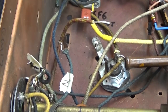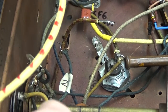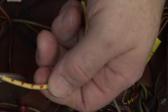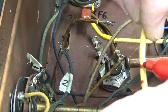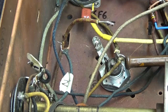You see this wire right here? If you look real close, you'll see that this is basically a yellow wire with some red tracer. So what I'm going to do is, since I don't have any yellow wire with a red tracer, I do have some yellow wire and I do have a red Sharpie — so why not just take a red Sharpie and make a yellow wire with a red tracer. Kind of makes sense, right? It doesn't have to be artistic or fancy. The whole idea is that someday somebody else is going to maybe look in this radio, and it would be helpful if we at least make an attempt to match the color code. Let me go ahead and finish making the tracer on this and get it installed. The reason I have to install this in the first place is that I need to extend that wire, and I'll show you why that is in just a minute.